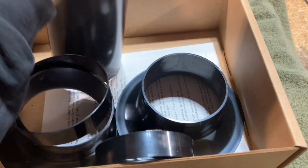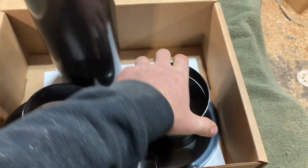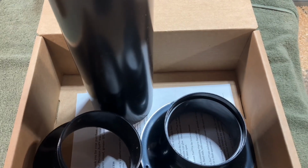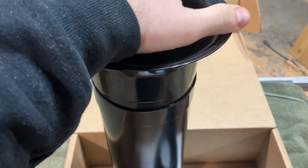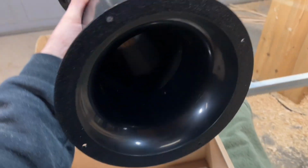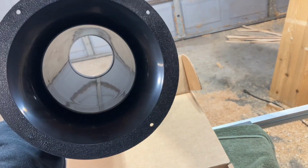Do with the 4-inch aero ports. So these are 17 inches long. Got 2 of them. And like a 3 cubic foot box should give me under 35 hertz tuning, I think, when I did the math. Let's see here. I don't know if I'm gonna use box tape or whatever. Not sure. To make them permanent, I might just put some CA glue on there. Yeah, these look pretty good. The flare should definitely help keep the chuffing noise down.